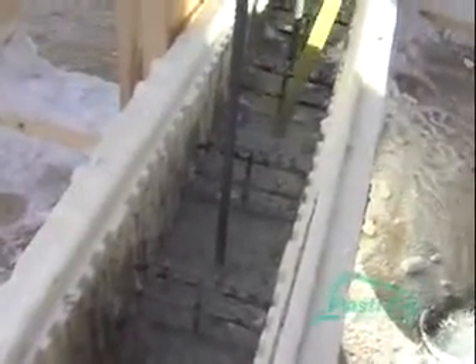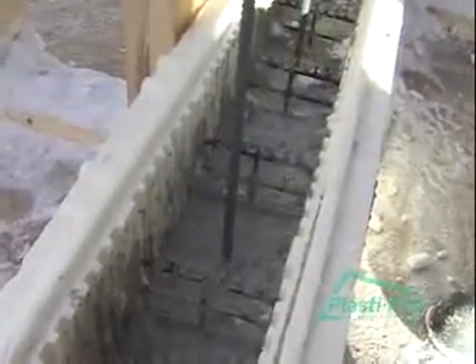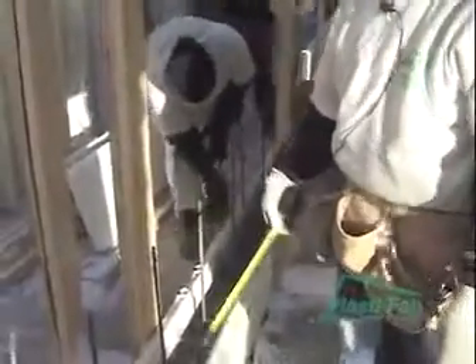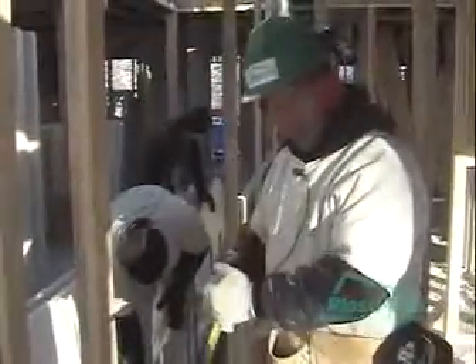When we have a situation like this — when we're tying a new wall onto an old wall — quite often we're asked: what do you do about the cold joint where the old concrete meets the new concrete? So that's why we put these dowels in. These dowels here tie the one pour into the other. An engineer usually figures out what kind of doweling you need based on the load you have. Right here we have 10M bar at 16 inches on center. That's sufficient to lap that cold joint, and everything should be good.